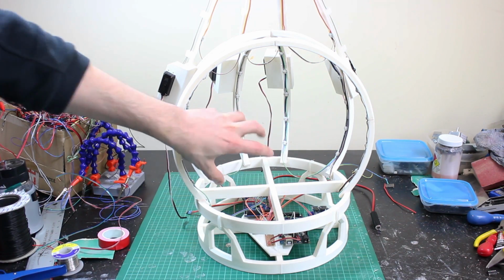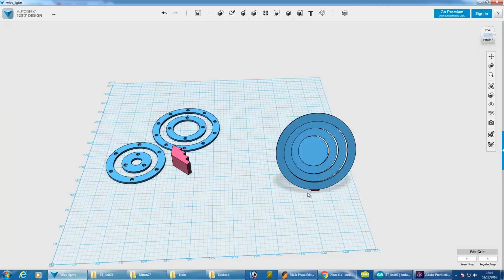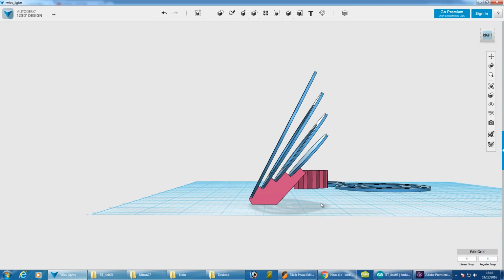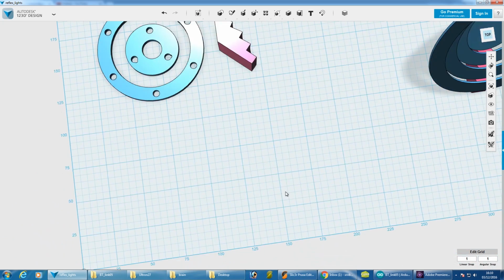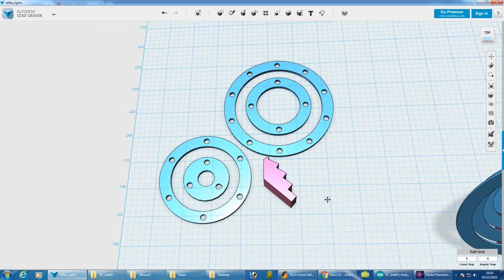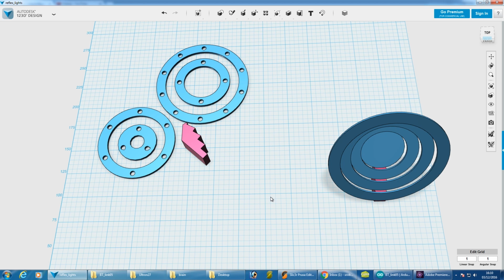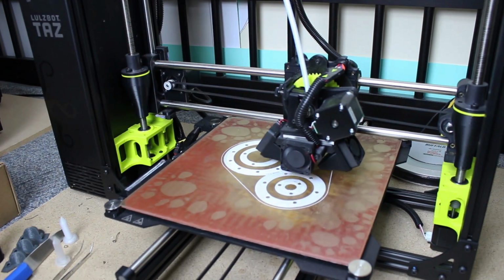And we're going to have some LEDs on, and we'll program those up on our main Arduino that deals with the reflexes. I'm going to make a thing that looks like this, so it's going to sit back at an angle and have concentric rings that are all spaced like so. Each one of these is going to have LEDs in it. I'm going to use normal 5mm LEDs for reasons that I'll come on to. So there's a number of LEDs in each one that will flash various patterns linked to the Arduino Mega. So let's get that printed and soldered up. Here they come.